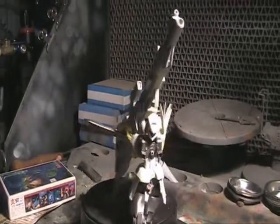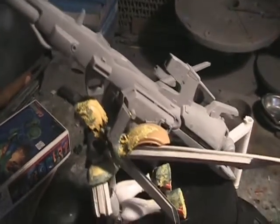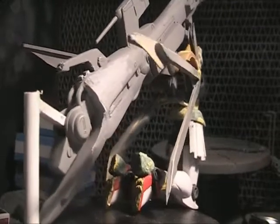Before I finish, I'll highlight the importance of using an etch primer or a proper lacquer primer on top of metal, as paint does not adhere to it very well and will rub off.